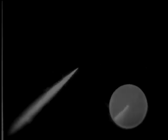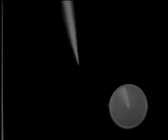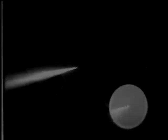Well, those coils that cause the electron beam to sweep back and forth to form the baseline are designed to rotate freely around the neck of the tube. Since it was the current flowing through the coils that produced the baseline, when the coils rotate, the baseline sweeps around the scope. The rotation of the coils, and hence the sweep of the baseline, is synchronized with the antenna, so that the baseline is always pointing in the same direction as the antenna.